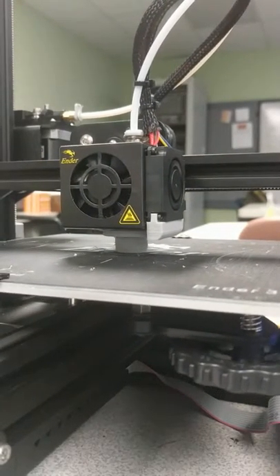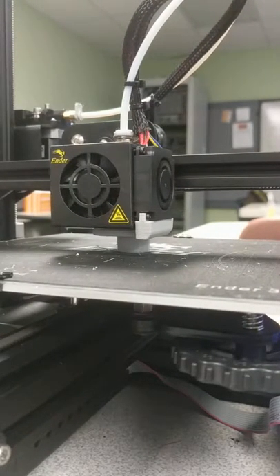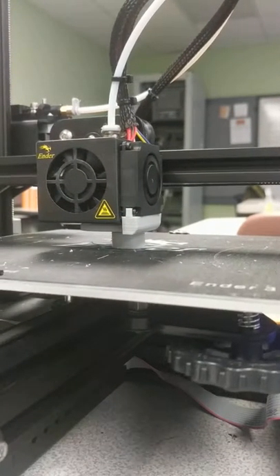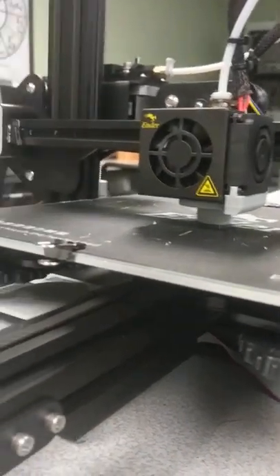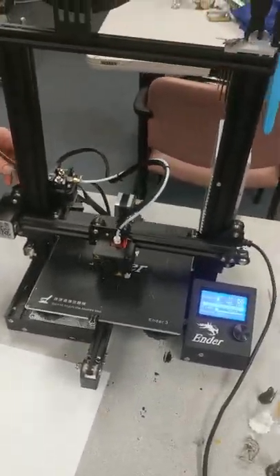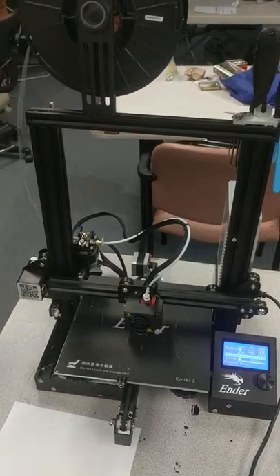You can tell it's working better than it was before. If you look down towards the first couple of layers, there's that skipping — where there's a little bit of edges. The next quarter inch of layers is fine. So basically where I see the dots, that's what you call skipping — that's just under-extruding. And if you had the sock on it or tape on it, it wouldn't be doing that, hopefully. Your adjustment to 210 degrees has kind of compensated a little bit.